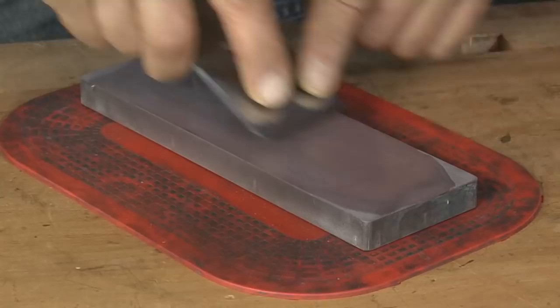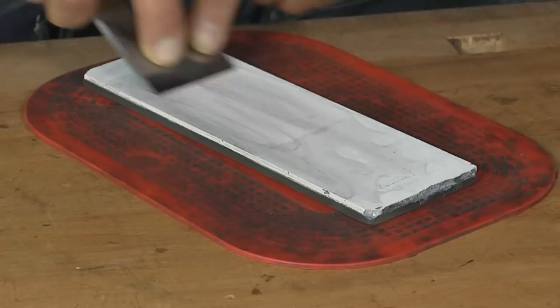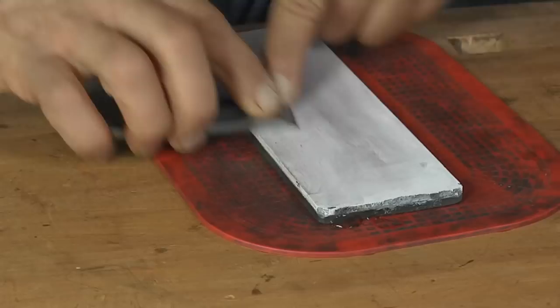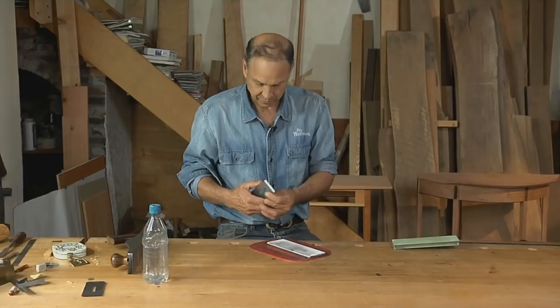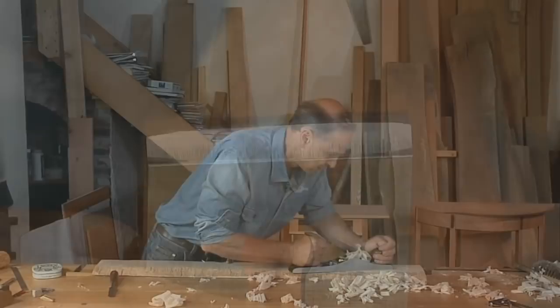I do have a very, very fine burr — that's a good sign. Moving on to the 8,000 stone, everything's the same on this higher grit; I'm just polishing the edge better, maintaining the same micro bevel. Then I'll do the back. I probably need a pretty strong microscope to actually see that micro bevel, but I'm sure it's there. With just a little bit of changes in the tuning and the sharpening, this plane will do a wide range of tasks — that's why I love it so much.